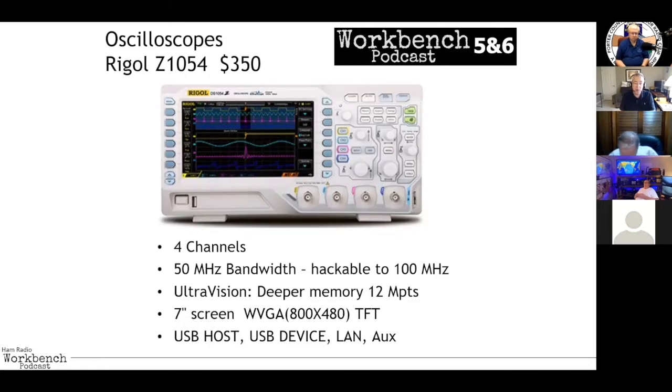The second spec that you look for is what the bandwidth of the scope is. When we say bandwidth, what we really mean is what is the highest frequency that the oscilloscope can accurately represent? And you have to really look at the spec because a lot of times that number is the 3 dB roll-off point of the scope. What that means is that if I say this is a 50 megahertz scope, and I have a signal that's switching at 50 megahertz, I could actually see it with the scope either correctly or as poorly as half of the signal amplitude. And for any faster signal than that, the amplitude will be lower and lower. So I'm really not reading it accurately at all. So the bandwidth just tells you how fast is the fastest signal you can really observe with the scope.